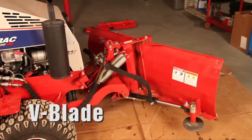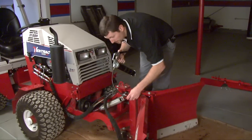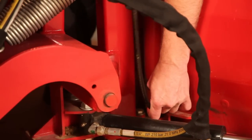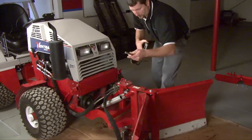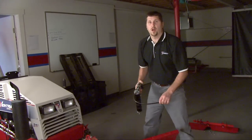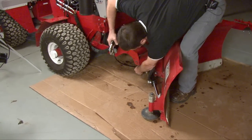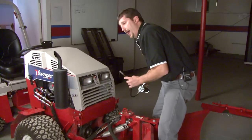On the V-blade, you'll want to have the wings angled forward so you can get to the center grease zerks. Some older V-blades won't have these, but later models do. There's one on top, one on the bottom — this is a shaft and bushing setup, so you can grease until you see it. There's also one on this side in the center. Each end of the cylinder will have a grease zerk as well. If you want better access, you can also flip the V-blade up on its front.